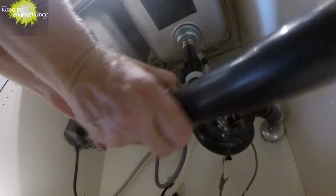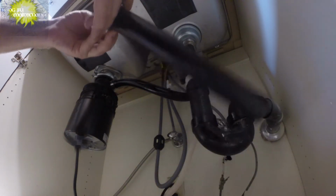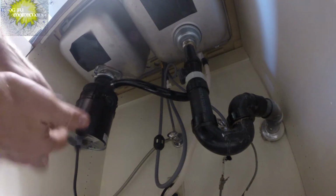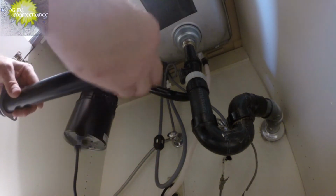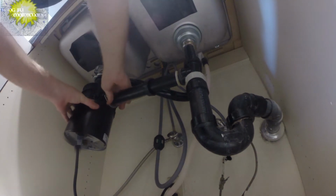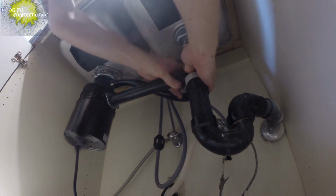Anyway, here goes the gasket. Follow it up with this piece here. Make sure there's no roll in our gasket and that it seats flush. This deal inserts like so. So the gasket pushes against the tubular end, and on this end we're going to slide in this piece, and the little O-ring beveled washer is going to go into this side, and then we're just going to rotate it in. Sometimes you'll need to trim them down. This one was exactly the right size, so it makes that nice and easy.